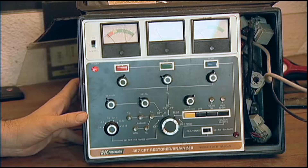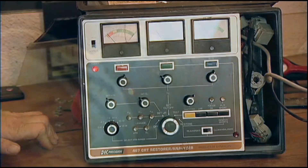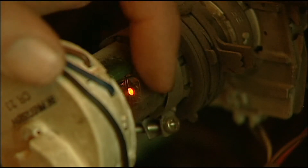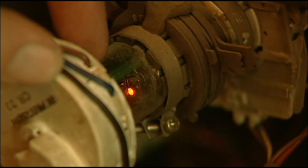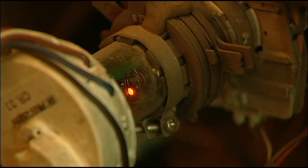I'm going to refocus on the neck of the tube — I want you guys to see what happens to the neck during the rejuvenation process. This gun here on the far right is the blue gun, the green's in the middle, the red's on the left. This is an inline gun. We're going to switch over to restore. You'll see that voltage increases to the filament, it heats up everything in there. I'm going to start on the blue gun here.